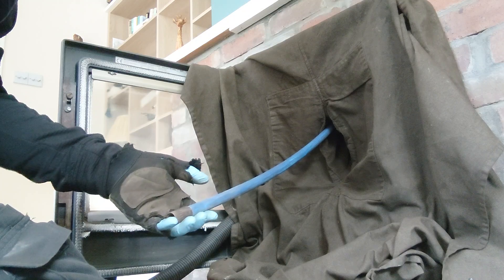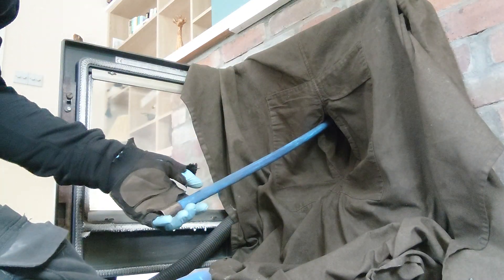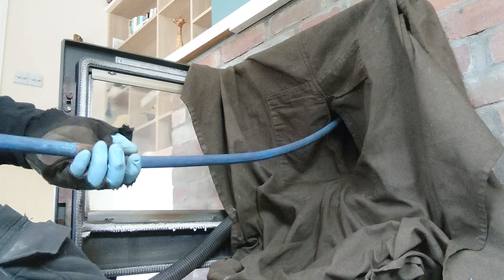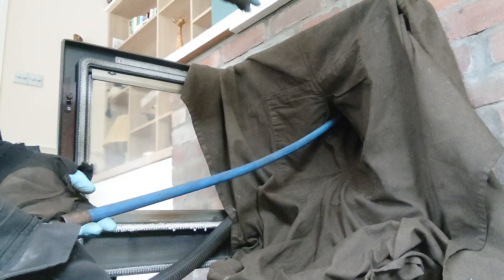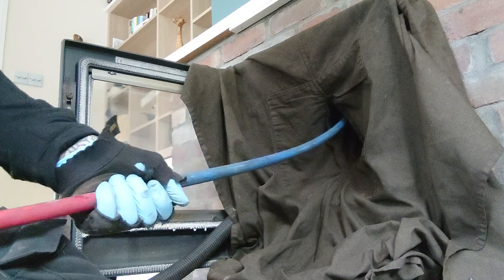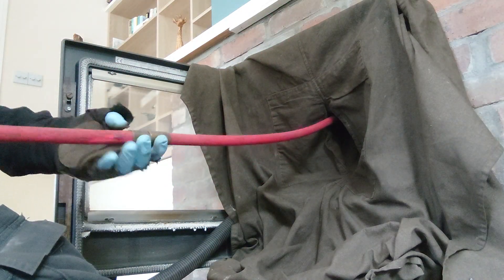It's always a good idea to go up slowly first, as I always say. A lot of people just go straight up and down three to six times if it needs it. I've never done that in 24 years of working because I don't know how dirty the appliance is, and depending on how my sheet is set up I might have to tape it up and make it more secure. Going up slowly allows me to work out just how dirty the liner is. The customer burns very good wood — no issues here at all.